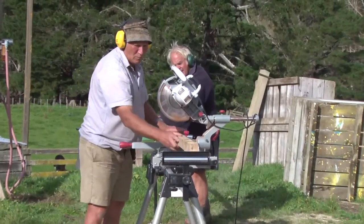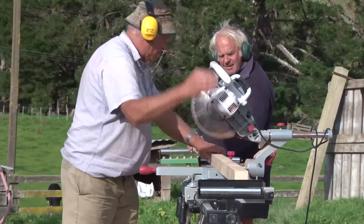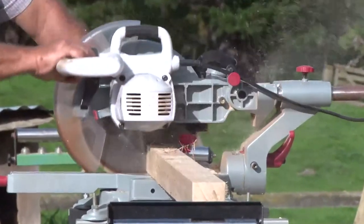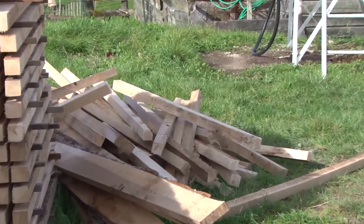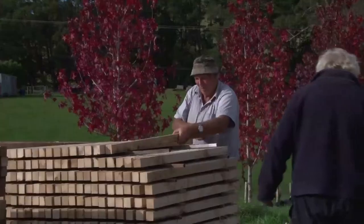Producing battens from milled poplar is one important function which can be achieved by milling poplar on the farm. But there are a few pointers to watch out for. Firstly, the process of drying is the most important aspect of the whole business of getting finished battens treated. The battens need to be filleted, and the fillets shown here are made of 15mm by 15 or 20mm by 20 of clean scrap, and they need to be placed evenly, so there's a gap between each batten to allow